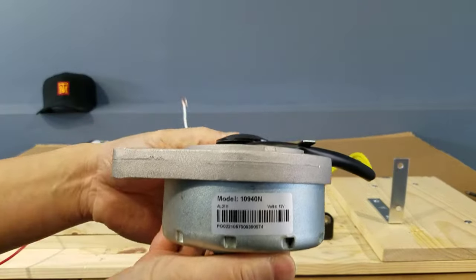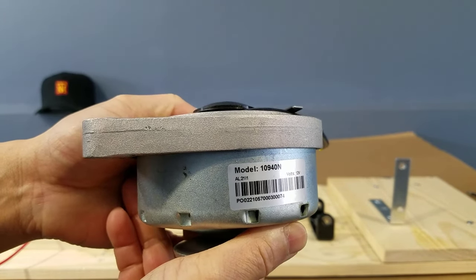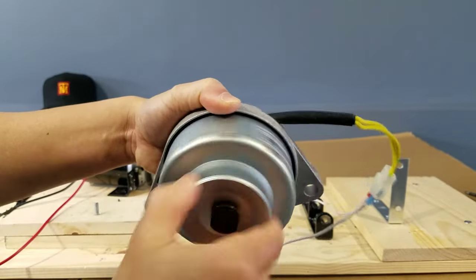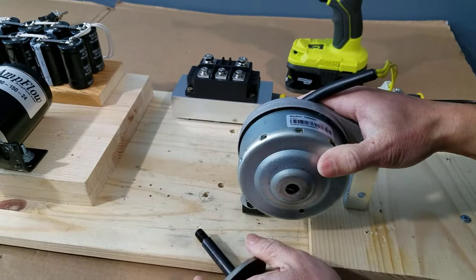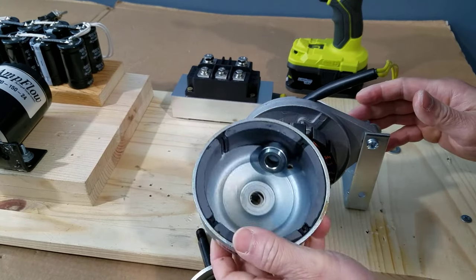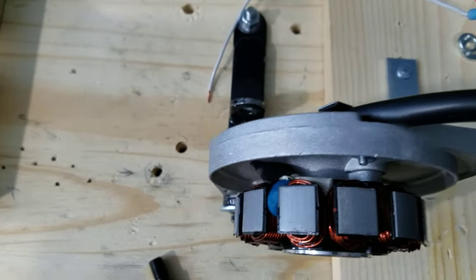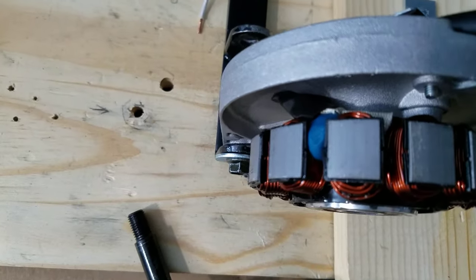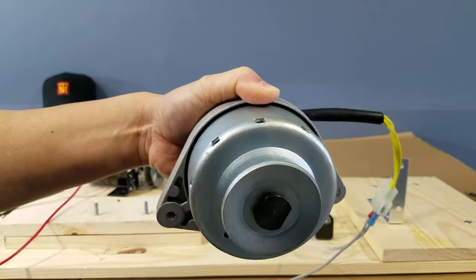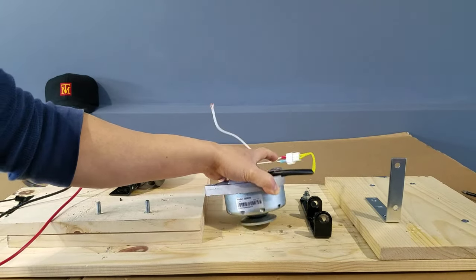This is a 12-volt permanent magnet alternator for tractors. It's supposed to come with a 12-volt DC internal regulator, but it does not. Oh yeah, I pulled it apart and checked. There was no internal regulator on the cap, and there's nothing behind the stator coil besides the wiring connections. And I have a plan for the 12 volt regulator substitution.